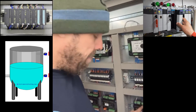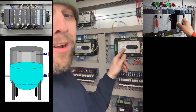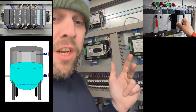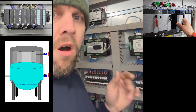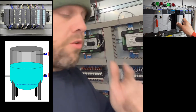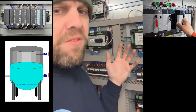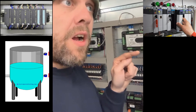A simple on/off IO signal requires very little data and can be checked regularly. Overloading comms with non-essential data clogs up the processor. In electricity and controls, what you can actually do is: turn something on or off, adjust voltage, adjust current, or adjust frequency — that's pretty much it. So all your IO, whether analog or digital, must be done as on/off, voltage, current, or frequency. Data protocols include RS485, RS232, PROFIBUS, AS-i bus, USB, and serial — all searchable online.